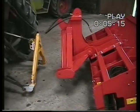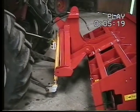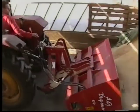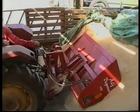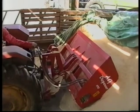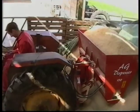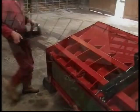As shown, the tilting mechanism can be used with an A-frame or a 3-point linkage. The linkage system allows the bucket to be tilted flat to fill for scooping up the material. If the AG dispenser is mounted using the linkage system, then ensure there is enough counterbalance on the front of the prime mover to compensate the load without exceeding the capacity of the prime mover.